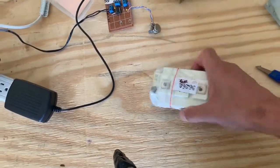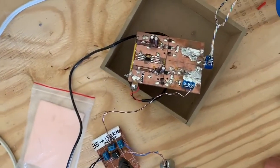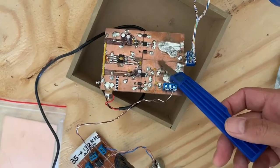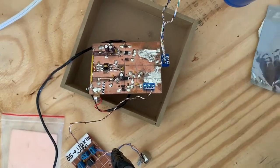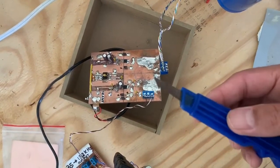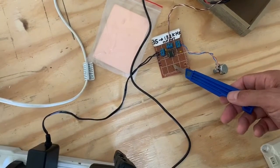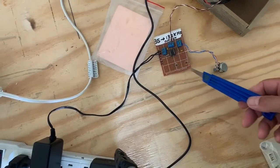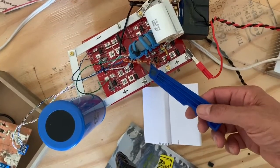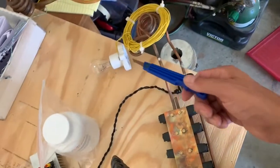In order to work something like this for an induction heater, you really need a more durable gate drive setup, which is what I've put together here. The one I've already made I'm going to feed with a square wave signal from a 555 timer chip to drive this mini brick full bridge inverter at the right frequency to cause it to resonate and light that light bulb.